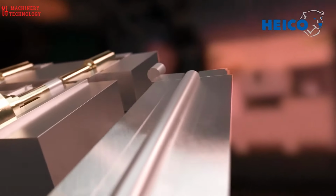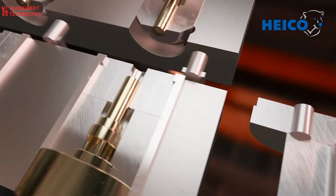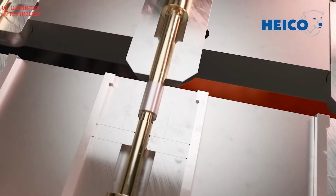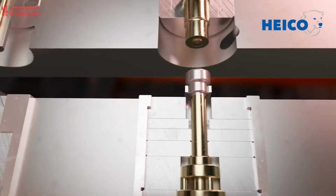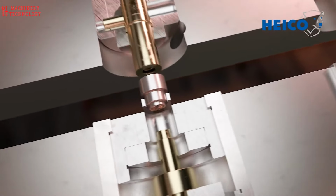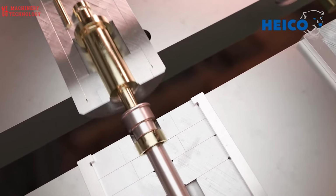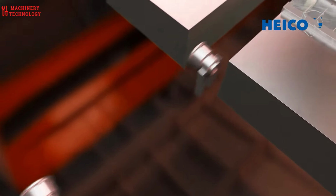Imagine a powerful press pushing a piece of metal into a mold, much like squeezing clay. This mold, called a die, has the exact shape of the final part. The pressing tool, known as a punch, forces the metal to deform and fill every crevice of the die under immense pressure. This cold forging process is a high-speed production technique used to create a vast array of parts, particularly those that require strength, a smooth finish, and precise dimensions.